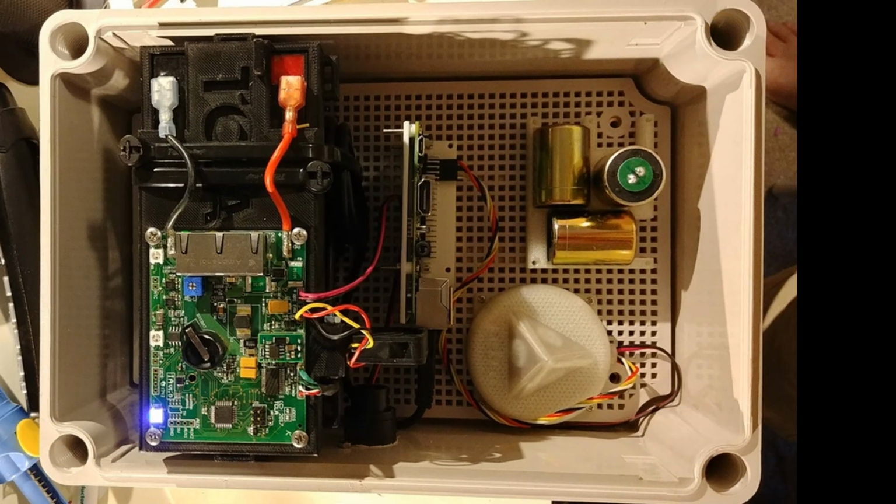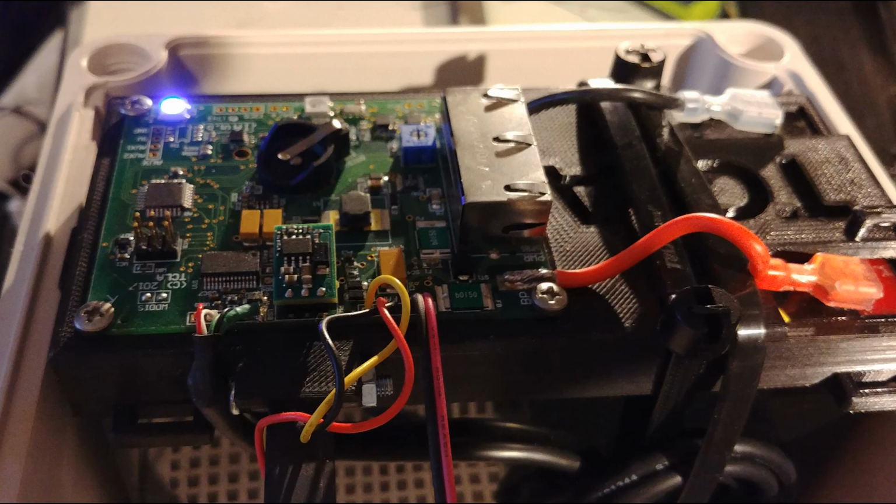If we open the box, inside we find the battery and a UPS/system manager, cooling, climate control, battery protector, little Linux machine, and a tetraseismometer down in the bottom right corner. The battery management unit sits on top of a 12-volt battery. It charges the battery from a power over Ethernet cable that could end in a power supply or in a solar panel. It makes sure the battery is not overcharged and it's not undercharged either. If it gets to 10.5 volts, it'll completely shut it off. This enables the battery to live for at least 7 years.